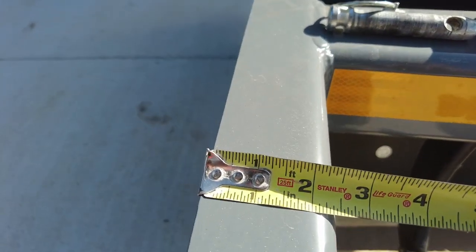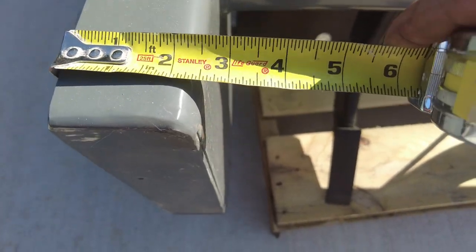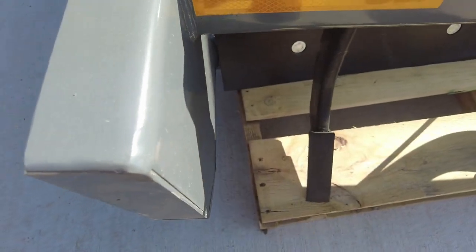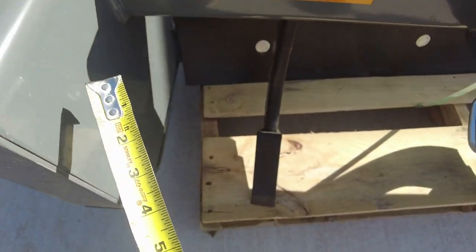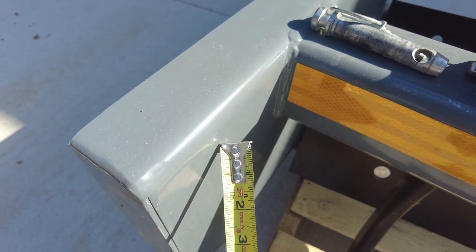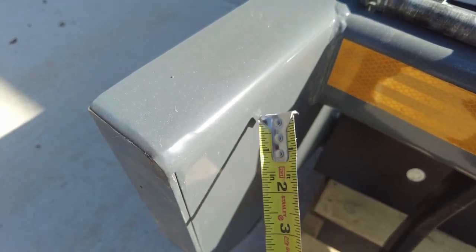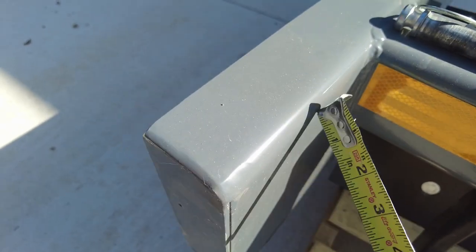This up here, 2.5 inch wide. And these are just plates welded together. Looks like this plate is actually bent on top. So instead, some people I think have used channel steel. This is just a cold form channel, probably put in a bender, then welded this plate on.